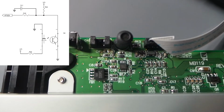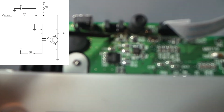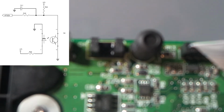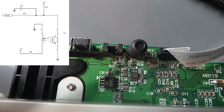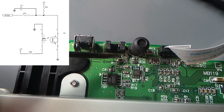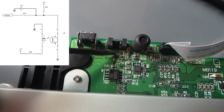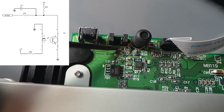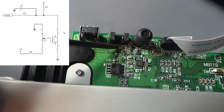Now, just for reference, that capacitor that I'm talking about is that one right there, labelled, if this camera will focus. No, it doesn't want to focus. It's better, sort of. C41. It's a surface mount capacitor, looks like about a 0603 size, which I've actually removed right now, but I'm going to put it back in and see if it still works, because that capacitor sits right across the output of that transistor. So whether that's causing the problem, we'll find out very shortly.